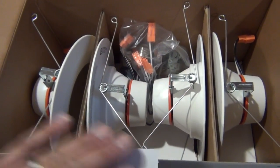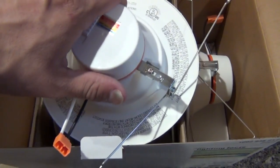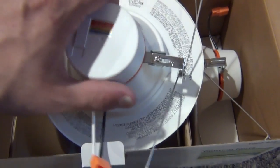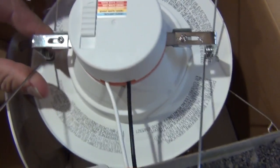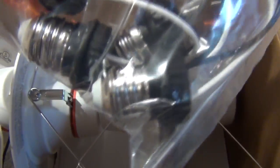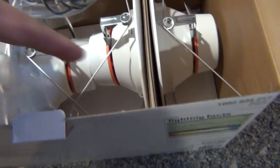Here's what comes in each individual kit. There's the instruction manual, though you probably won't need it since the install is pretty straightforward. You get four lights to install into four individual high hats. The kit accommodates a five and six inch recessed light housing — most common is the six inch, which is what I have. They come preset for six inch, with a clip that slides back and forth. The kit also includes wiring harnesses: you remove the bulb, screw the adapter into the socket, and plug the quick connect clip into each trim baffle to power the LEDs.